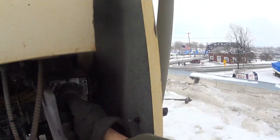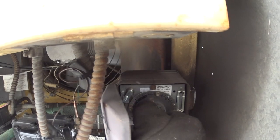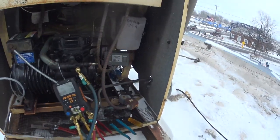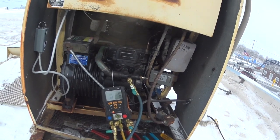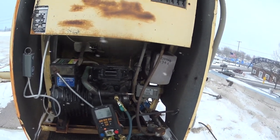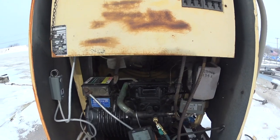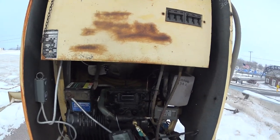All I have to do is take it off the frost. The time clock here — it's on the frost, see the pin is lined up. It just came off the frost. The solenoid valve just opened up, it's letting the refrigerant go through it. The pressure's building up and it's going to kick in around 16. It was kicking in at 20, I lowered it down to 16. I insulated the tank and put the heater on it, and we put this control so the heater will shut off if it's above 20 degrees outside. That'll keep this system running pretty healthy.